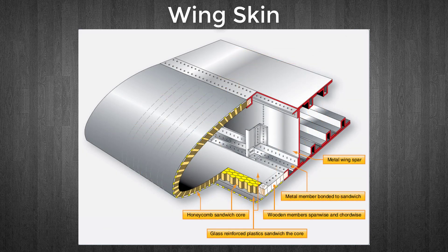A honeycomb panel can be made from a wide variety of materials. Aluminium core honeycomb with an outer skin of aluminium is common. But honeycomb in which the core is an aramid fiber and the outer sheets coated phenolic is common as well. A myriad of other material combinations such as those using fiberglass, plastic, Nomex, Kevlar, and carbon fiber are also used. Each honeycomb structure possesses unique characteristics depending upon the materials, dimensions, and manufacturing techniques employed. This figure shows an entire wing leading edge formed from honeycomb structure.